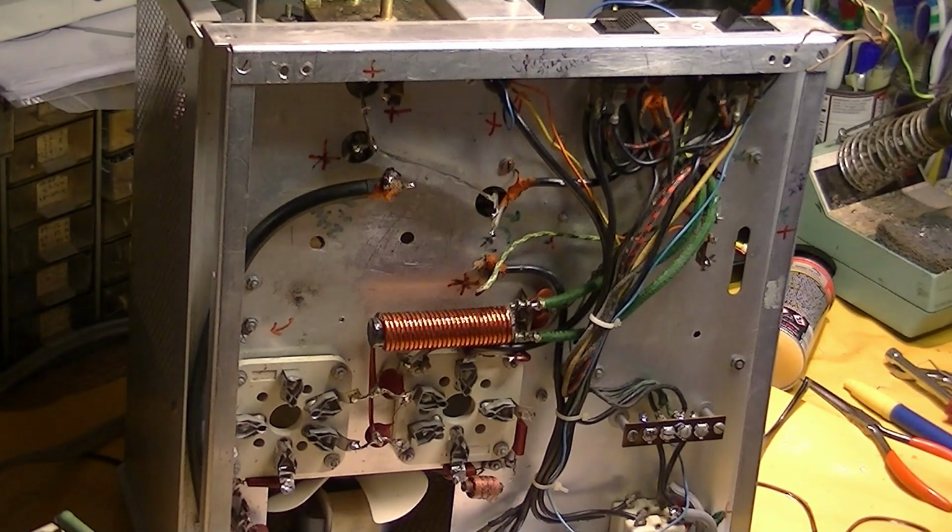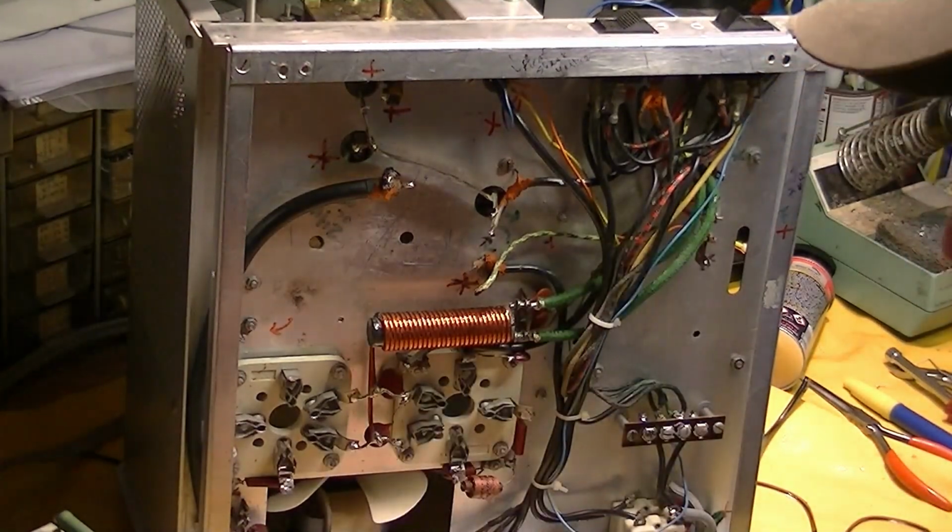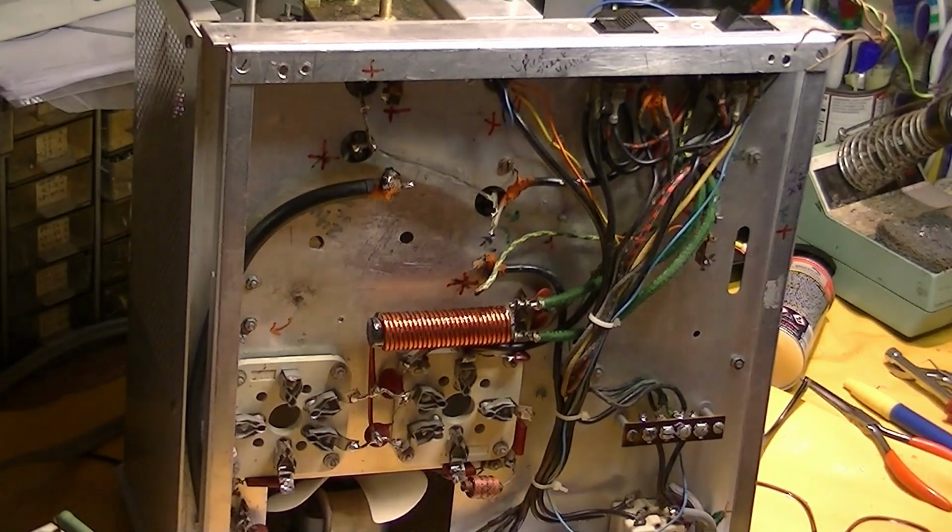The thing has enough dynamic range in the power supply to work as a sideband linear amplifier just fine all these years. So, there we go. Plenty of people are using these. I guess it's working okay. They've probably used better diodes and higher peak inverse voltage diodes in the new Harbach power supply board. I certainly hope so. So maybe that eliminates most of the problems. But that's what's being done when you use the Harbach kit. And I'm tired. I'm done for the day.